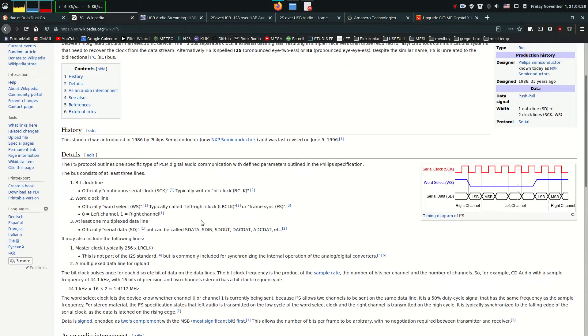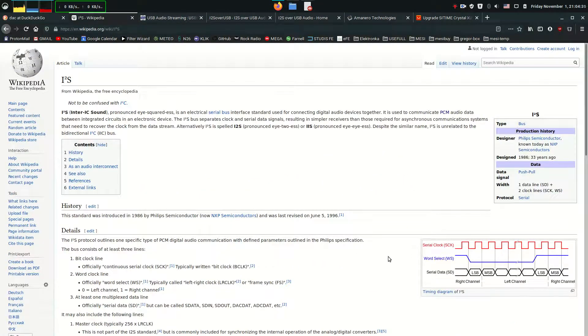This is the I2S physical protocol, but the protocol that handles how the data is transferred is different. The most well known are PCM and DSD — DSD being the buzzword for new hi-fi equipment. PCM works exactly like shown in the I2S diagram, sending packets of audio for left, right, left, right. Meanwhile DSD has much higher clocks and just sends data continuously — it's not in packets but a direct stream, which in theory ensures better quality.